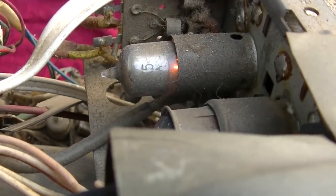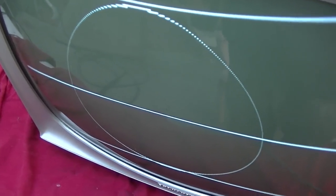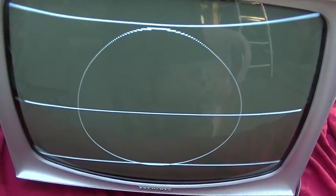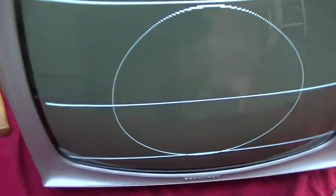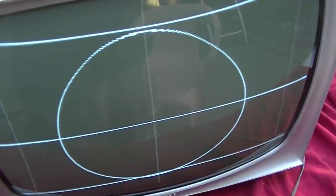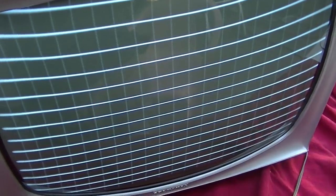As she warms up here, I bet it's going to work — glowing nice and bright. Yeah, that's a weird kind of failure to just happen. The vertical — oh yeah, rock solid! Look at that. That circle's a little distorted though. Still a pretty sensitive receiver. Yeah, we've definitely got a little linearity issue there. Strong CRT.